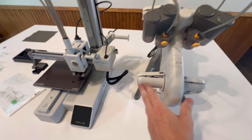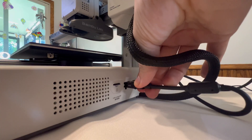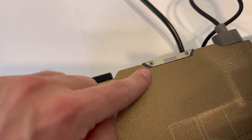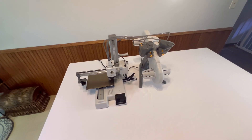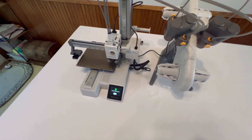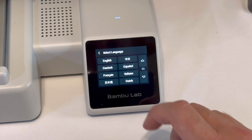The AMS needs to be at around 8 to 10 inches away from the printer. Our next step is getting the cord ready for the AMS and plugging it into the side of the printer — it's a five-prong plug-in. Next, add the build plate to the actual printer itself; it is magnetized, so line it up with the back of the design. Then make sure the 3D printer is plugged into the wall. Our last step is to turn on the printer — there's a little on switch in the back. Initiating power in three, two, one — the printer is now ready to go.